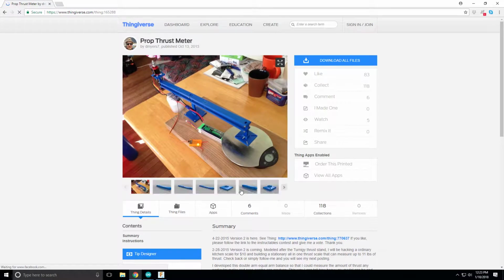So here's from the same guy. Here's kind of a conventional one. So basically you have what's called a lever arm, and we're going to be talking about torque, which is a measurement of turning force, and units are force times distance. Generally what you do with these rocker styles, which is the style that we're going to design, is design one that fits 6, 7, 8.5, and 10 millimeter brushed motors for small micro brush quads.